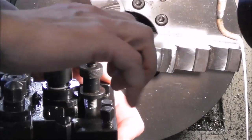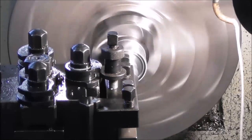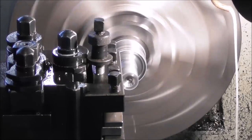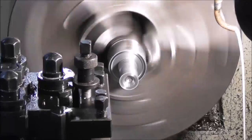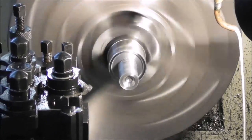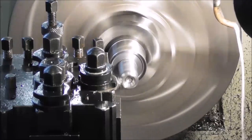This tool is going to do several operations: it's going to provide the centres for cylindrical grinding, provide the thread clearance, and the shank for another portion of the job. Now we're going to put in DRO tool offset number three and do the radius entry for the TTS. And that's the OD done.